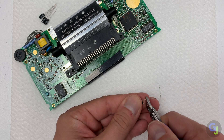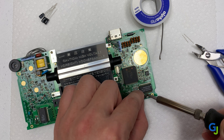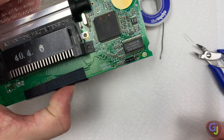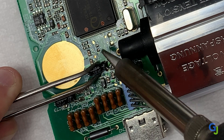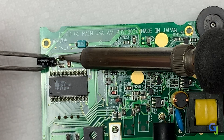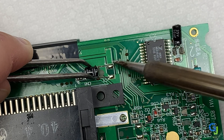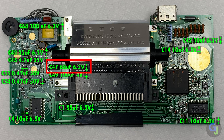Trimming the legs on each cap so they are tight to the board when soldered in place is a necessity — the legs are too long and if installed at this length, it'll probably cause fitment issues with the shell. I like to tin the legs once they're cut and hold the new cap in my left hand while I'm soldering with my right. Tweezers are very helpful for holding the caps, and in tighter spots they're pretty much required. Soldering in these parts is a little backwards to the traditional process — I like to add solder to the tip of the iron rather than adding it after the joint is heated, since I'm out of hands. The four small gold discs you'll see around the board are areas that cannot be covered by any components whatsoever — these are the back of the button pad locations and some caps will be very close to overlapping on those spots. Take your time through this entire process and check each cap's polarity once it's installed.